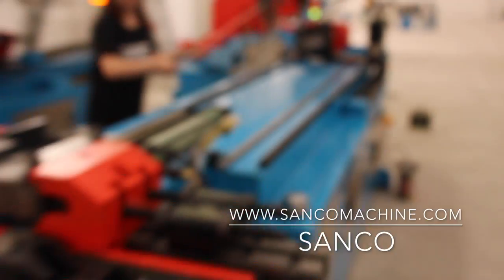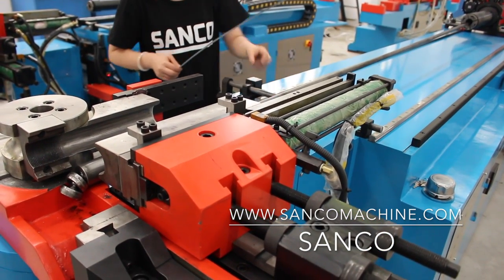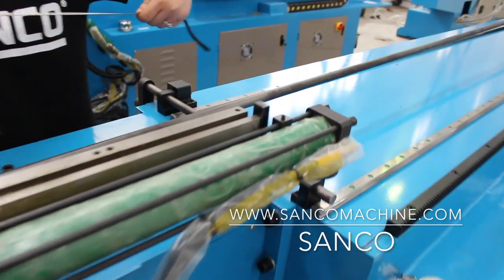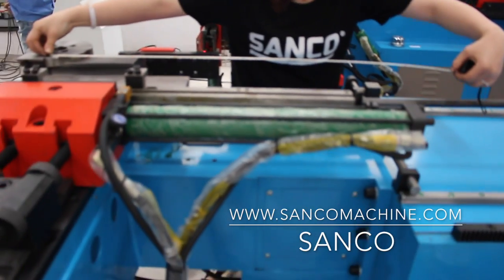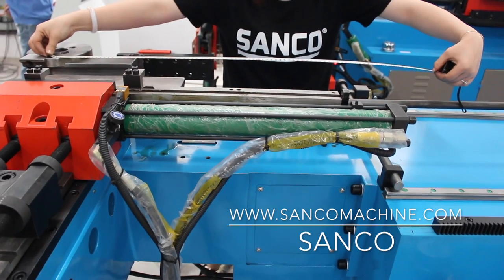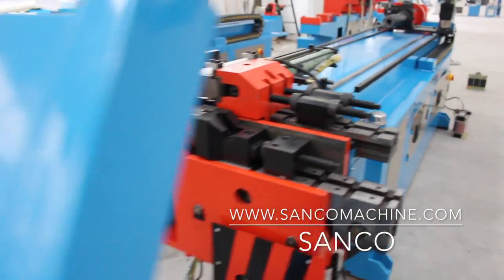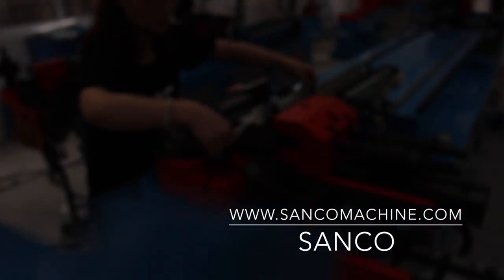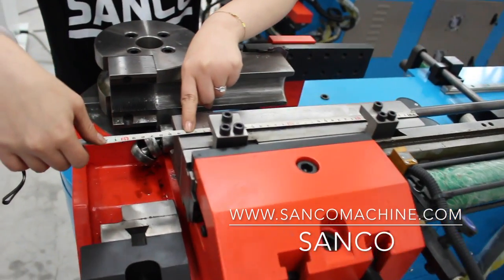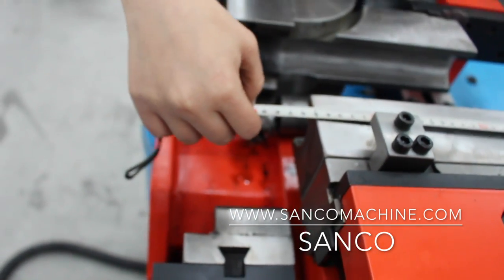Interference length: when the carriage comes to the bracket position, the bracket automatically goes down, so the length is measured from that point. We set it as 900mm for safety. The length of the guide mount is this length here — you can set it a little longer for safety. We set it as 400mm.